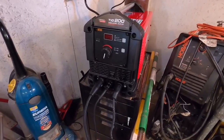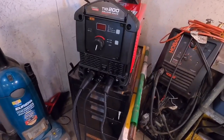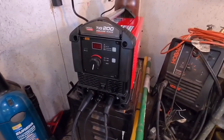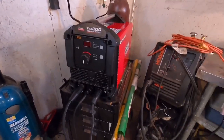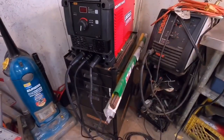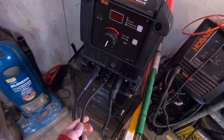I'll go over a couple quick things on this welder — I'm not going to go crazy in depth because there are plenty of reviews on YouTube. But from a guy who's had an AHP and now this: I have run a couple beads and it's working really well. It does AC and DC and stick — who needs stick — but it can do pulse. The pulse is not as sophisticated; it's basically just an on/off timer. You can adjust the AC balance and AC frequency on this, same as the AHP. This welder will weld aluminum, mild steel, and stainless steel. Just from looking at it and feeling everything, this welder is so much higher quality than the AHP.